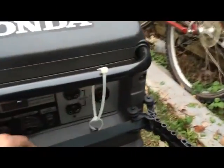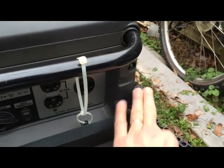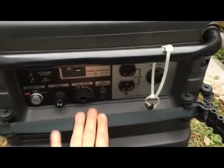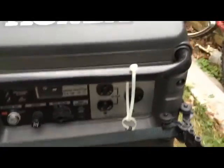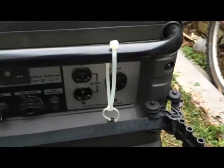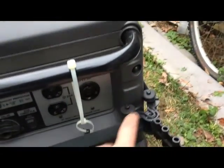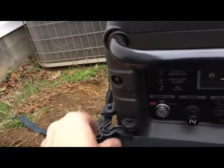The mounting brackets are held in with the strap with the ratchet lock on the side. The kit comes with four of these corner brackets and 16 grommets — eight big ones and eight small ones on the other side. Here on the electrical panel side of the generator, I've used the corner brackets with the four large grommets here, and to get the angle of the gen tent right, fortunately it worked out very easy. On the electrical panel side, I've got the upper set of grommets nesting in this case indentation here, and same thing on that side.